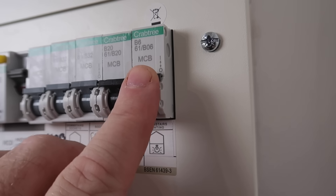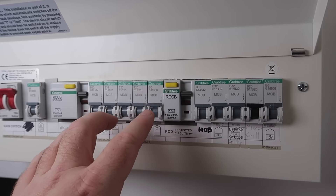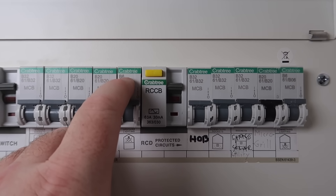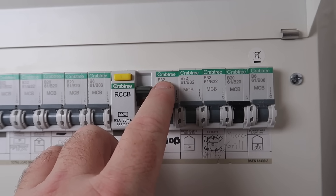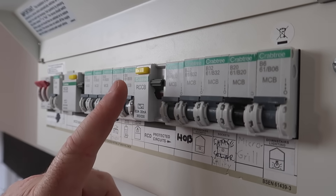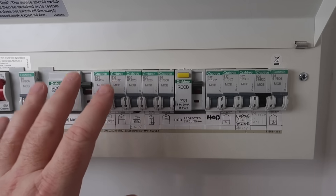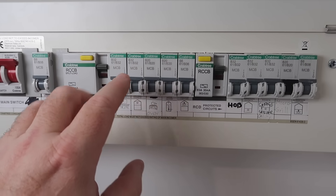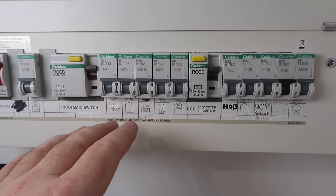Although you can sort of look at MCBs as modern-day fuses, they're more sensitive than a fuse — they'll trip quicker and they can be reset. Each one relates to a different circuit around the home and although all of them will be 230 volts, each one is designed to take a different load. For instance, a lighting circuit is on a 6-amp supply, where something a bit heavier like my electric hob is on a 32-amp supply. These breakers are here to protect the cables and the installation downstream — not necessarily to protect you. This is to protect the actual installation, and the cables on each circuit are sized to cope with the maximum load, so if the circuit is overloaded the breaker will trip before the cable starts melting.